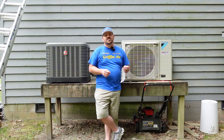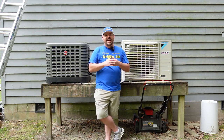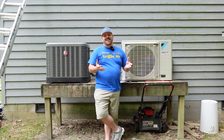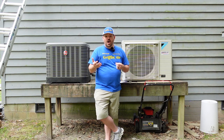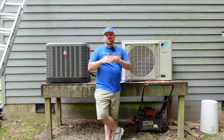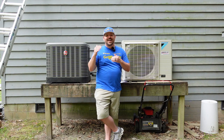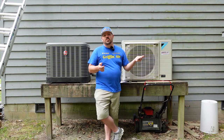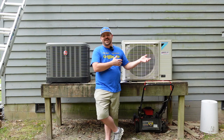Before we get started, when you see the decibel levels, a lot of people don't quite understand how big the difference in sound levels really is. When you go from a standard conversation around 60 decibels to 90 decibels like a lawnmower, the difference is not just 30 decibels or 30 times — it's actually 1,000 times louder to your ear. So as you'll see in this video, there's a significant difference in how quiet an inverter system like the Daikin Fit is.